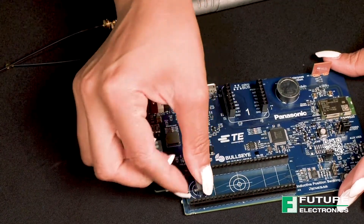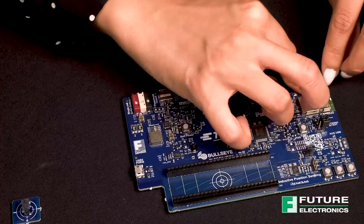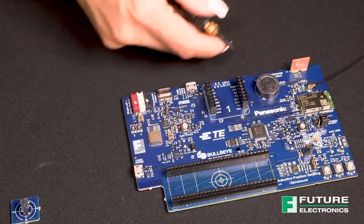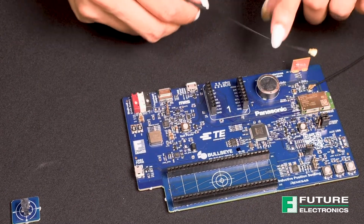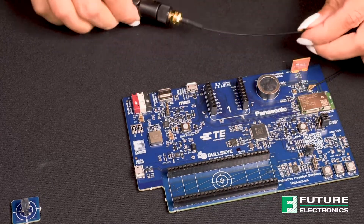Place the small actuator board anywhere in between the two guide rails over here. Next, connect the flex PCB antenna to connector J3 and connect the paddle antenna to connector J4. This concludes the hardware setup.